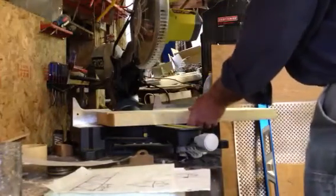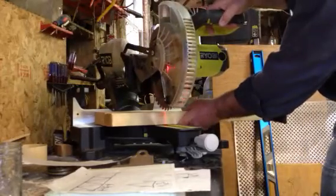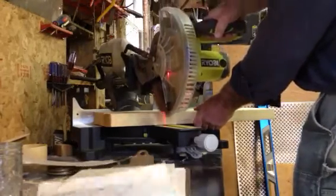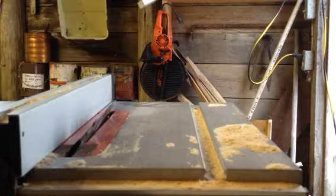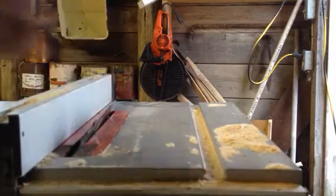I've got my board marked for 17 inches and I'm very careful about which side of the saw I'm on. Now we have our stock piece. I have the saw set up with a 30 degree angle from vertical, and because we want that one and three quarter, we need to take half of that, which is seven eighths. So this fence distance is seven eighths.